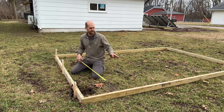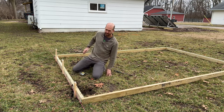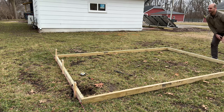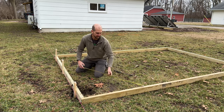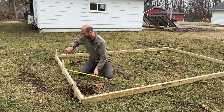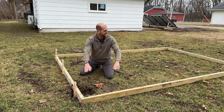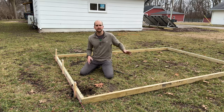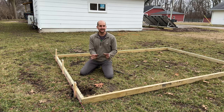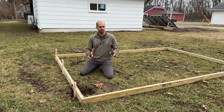I was just a little bit off, so I made a small adjustment to shift that wall slightly, re-measured, and got right at five feet. Now I know the back wall is good and I have a nice 90-degree corner. You could also measure the diagonals, but right now this is good enough for locating the three skids — I'll do the full diagonal check once we actually build the floor.